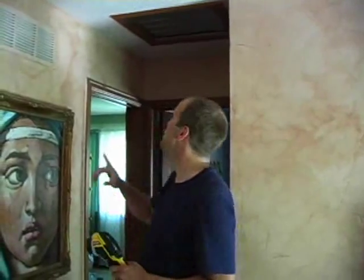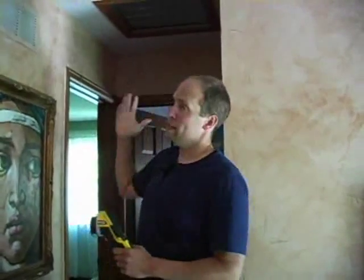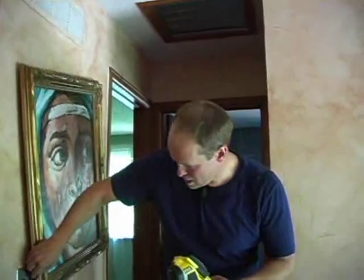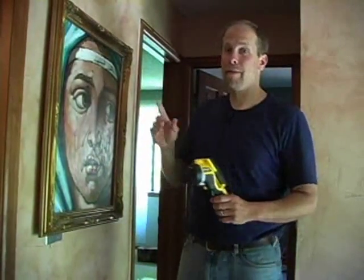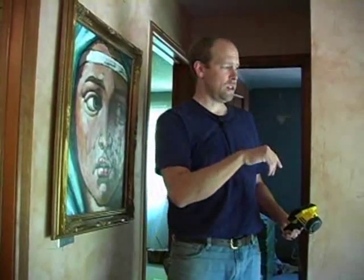We got kind of lucky — this house has a whole-house ventilation fan. This draws a lot of air from the house right out through the attic and outside the vents. These fans are usually very large — many hundreds of cubic feet per minute. This is going to pull a lot of hot air through those apparent defect areas we may find. It's an older house, almost 30 years old, so the insulation value may not be great in certain areas. It's set on high — I'll leave it there. Everything's closed up and I'm producing a low air pressure system. I'll let it run for about 15 minutes to give us good airflow patterns typically around windows and doors.